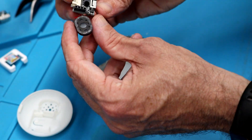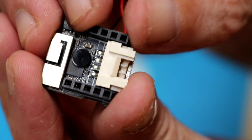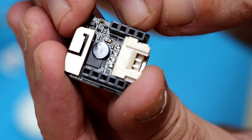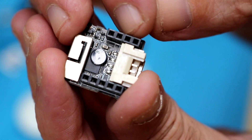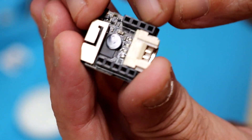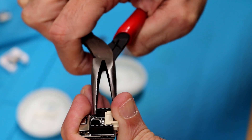This header right here is what you're going to be soldering to, but we're going to solder to these first two pins. I'm assuming you already know how to flash Arduino and how to solder — I'm not going to explain that. This first pin is ground and this is the five-volt power — we're going to go to the first two pins on your power board.